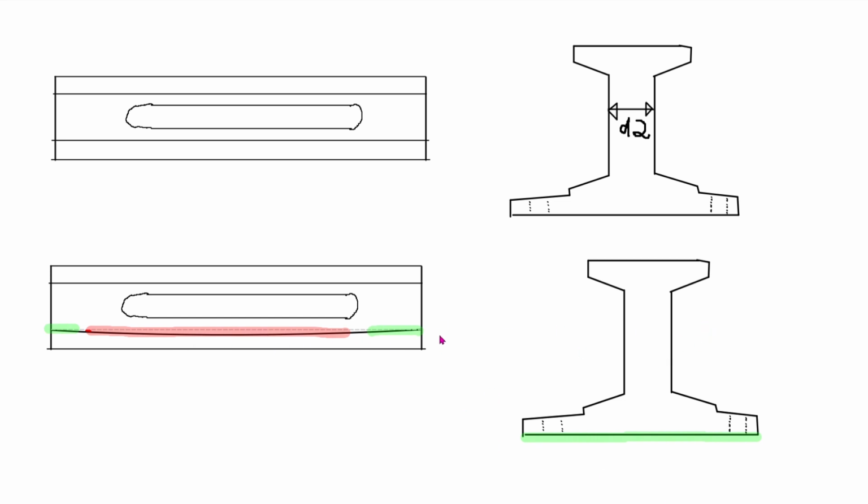And with the mill you clamp this down, and then you just can use the top as a reference. It should be okay, the top, to get left and right, get this aligned, and then you machine this. You should check the top first. Sometimes there are little spots, but it shouldn't be worn down, because if that is also worn down, then you don't have much of a surface to go against. You could probably use the side then to get everything aligned.